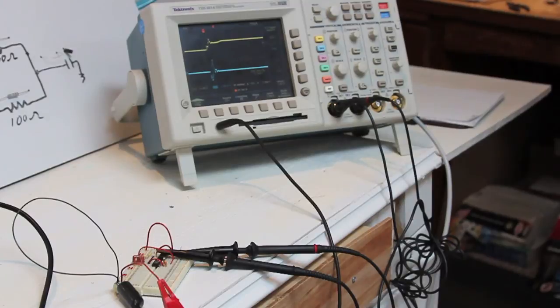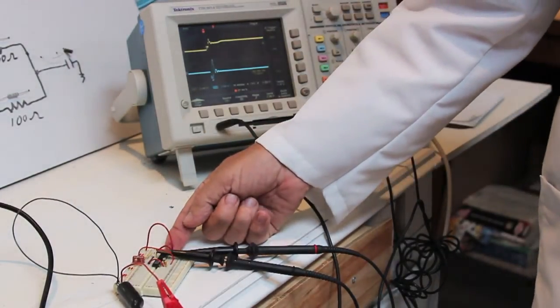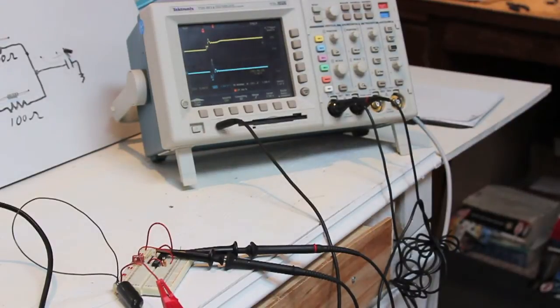One of the most common applications or uses of capacitors is to decouple a power supply circuit. What the heck does that fancy word mean? It means to make it quiet when it would otherwise be noisy. Here I put together this little circuit, a couple of integrated circuits. It doesn't really do anything except generate some pulses, but it will illustrate our purpose.